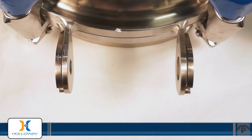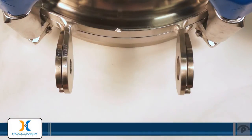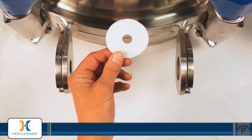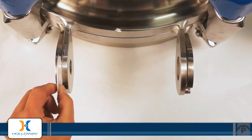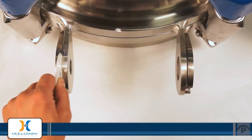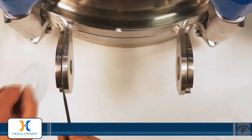To begin, on the left hand side of the assembly, we have a washer with a small hole for the hinge pin. It goes between the cover hinge and the collar hinge. You may not be able to push this washer in there — you may have to use a tool like a small screwdriver to go between the hinges.